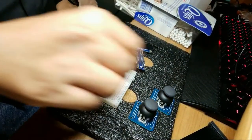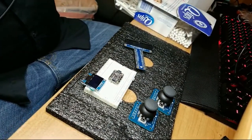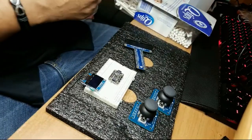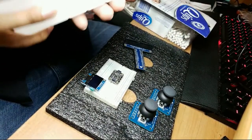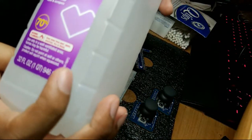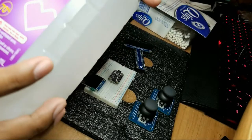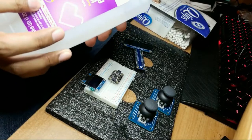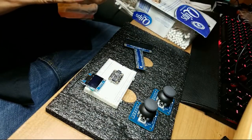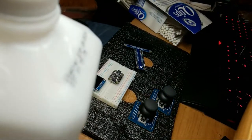So in order to do this, so the entire process of soldering, we're not even done yet, because now we have to do the cleaning portion of it. And I shall be using some 70%, not the best. You might use acetone, you might use actual flux removal, but 70% rubbing alcohol, just isopropyl alcohol, is sufficient for what we have here with our handy-dandy Q-tips.